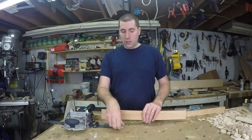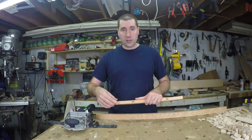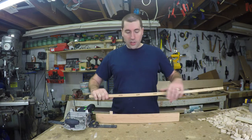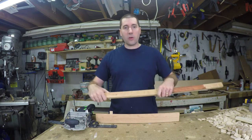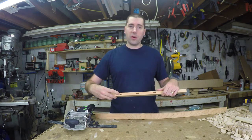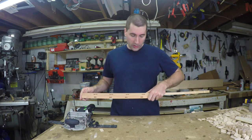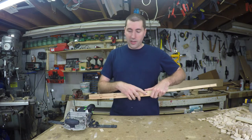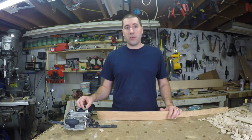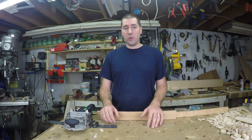However, there's an issue. When I glue two boards together, I'll put mortises on one board nice and tight so the domino stays in and stays perfectly vertical, and on the other board I'll make the bigger mortises so everything goes together easier. The problem is that because these pins register on the end of one of the mortises, if you do this quickly the mortises start to not line up as you go along. So these might be fine, fine — but then these two aren't going to line up. When you go to glue it up it's not going to work. Basically, if you want to use this, you have to keep it on the narrow setting on both sides, which means your mortises have to line up perfectly, and it can make your glue-ups a lot more difficult.